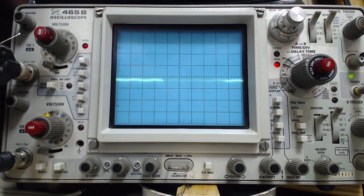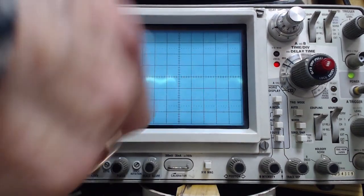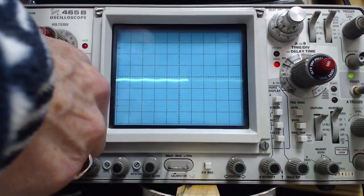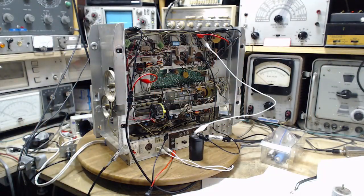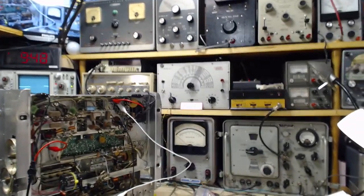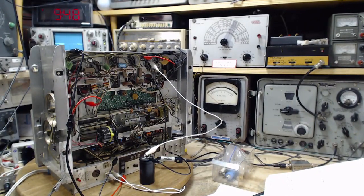So I do not hear a hum. See, there's still a little bit of hum there, but look, this hum is in the range of the RF noise in the circuit. That's tiny, tiny, tiny. So we are down to some tiny amount. Now the trick here is I'm using relatively small speakers, and because I could hear the hum with these little speakers, I can't be sure that the reason I can't hear it now is not because of those speakers.